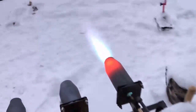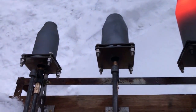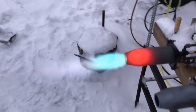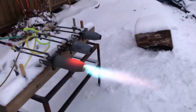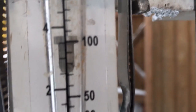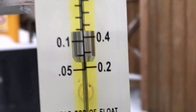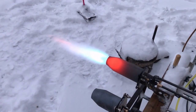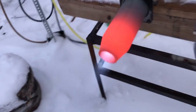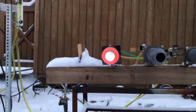These burners can burn any fuel by the way — waste oil, just about anything you can get in them. So any of that heavier fraction oil you guys have in your sludge, you can mix your good fuel with some of that fraction sludge out of the bottom of the distillation tank and make a thick fuel out of it that these burners will burn. Me and you need to discuss this — we can take the sludge you guys get or the oil and make fuel out of that stuff. It might even burn it by itself — these things are that good at burning sludge.